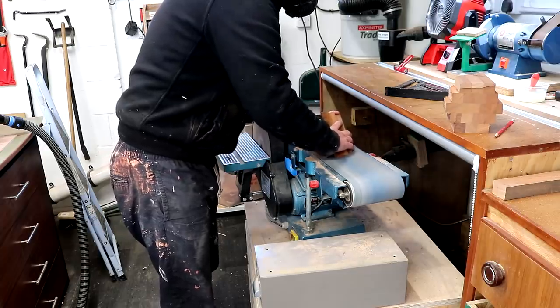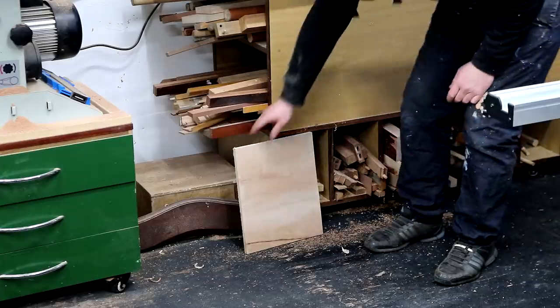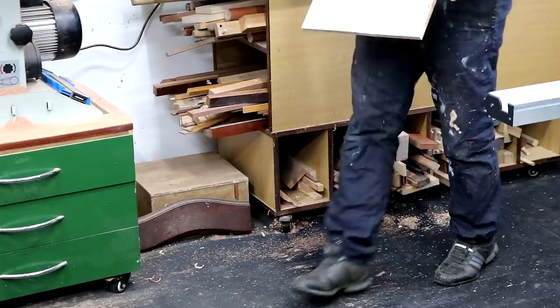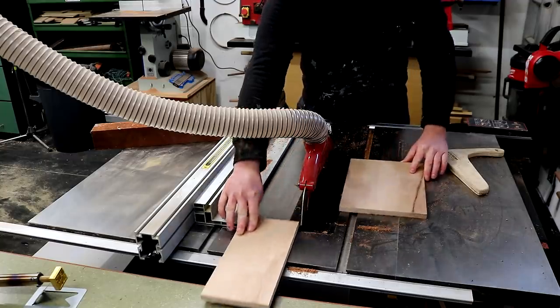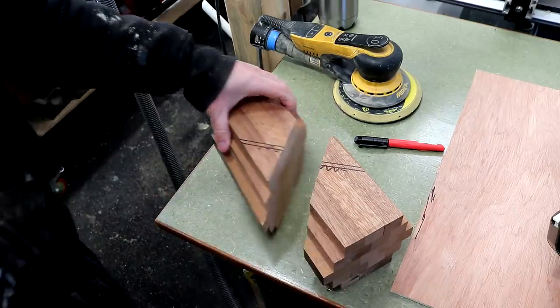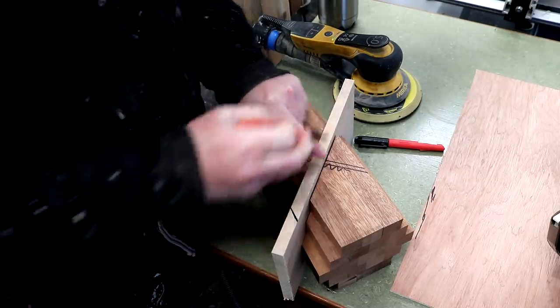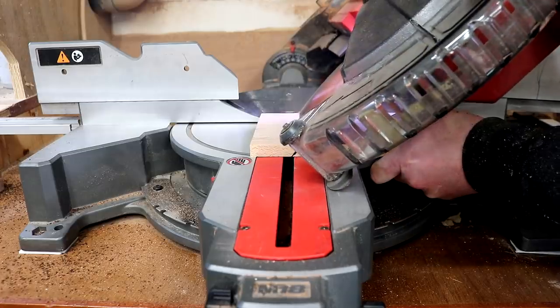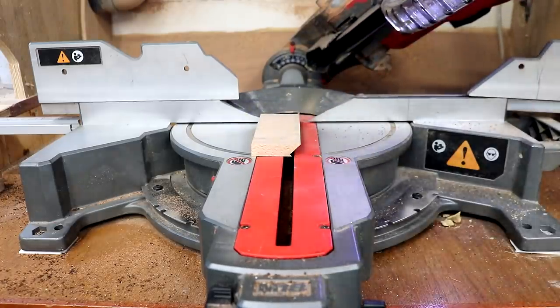I'm using the speed square instead of my mitre gauge that came with the saw because it was useless. Then I lightly sanded those cut areas at the belt sander. I have this other thin off cut of beech which I'm going to rip down and splice inside the 45 degree cut. I got the idea from a wood turning video by Square Peg Tommy on YouTube — I'll leave a link in the description. He used maple and walnut but the beech and mahogany I'm using should provide a similar contrast.